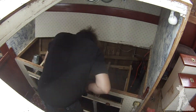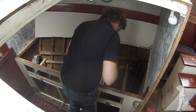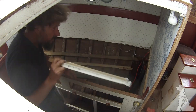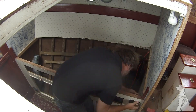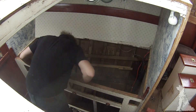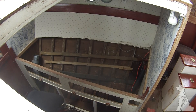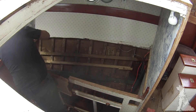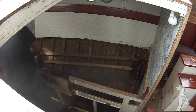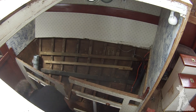On the starboard side I'll have reduced the amount of room, but I won't put a berth back there - I'm going to build a little nav station. In the wheelhouse I'm actually going to move the helm from the port side to the starboard side, as all new boats have. I'm doing that for space planning and safety reasons - boats must give way to other vessels on their starboard side and it's difficult to see them from port. I also intend to do a lot of canal and possibly lock transits, and I think it'll be much easier from the starboard side.